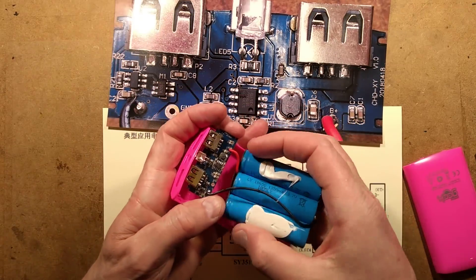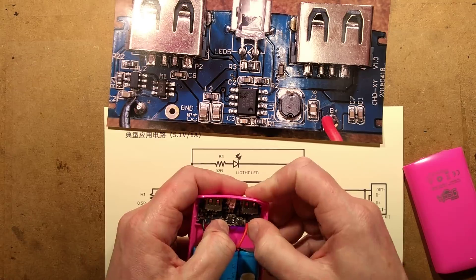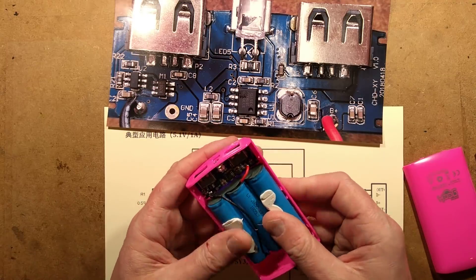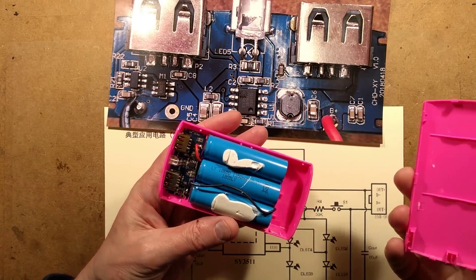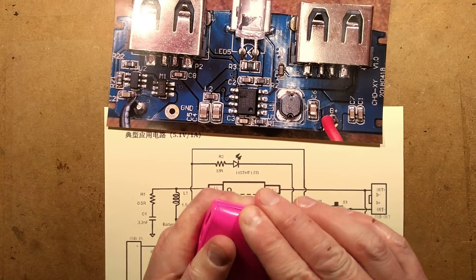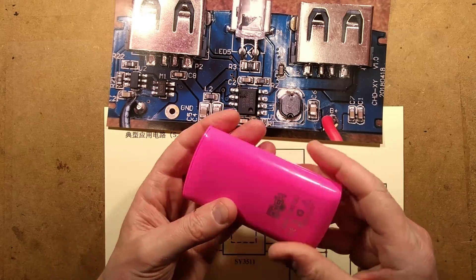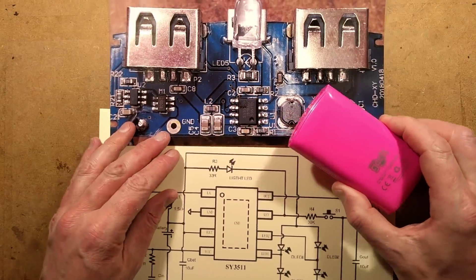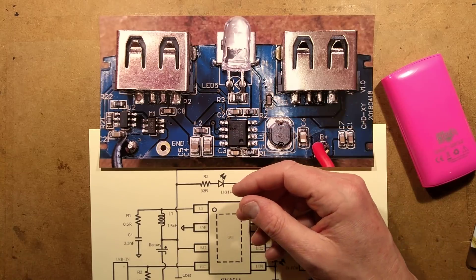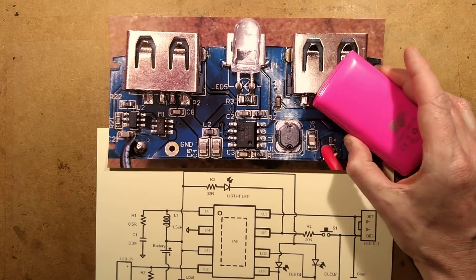Let's see how well it goes back together. The hardest part is usually seating the circuit board, but it actually went in quite easily. The case clips together well when the wires are laid in correctly, so this is fully openable and closeable - you can open it and put your own batteries in. To sum up: the chip doesn't overheat at 1 amp output, it always puts out 5 volts, and it has that extra battery protection with a DW01 and good output filtering. This is quite surprising - it looks pretty good indeed.